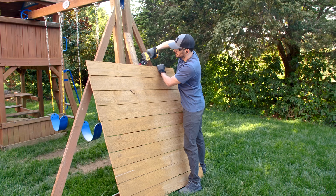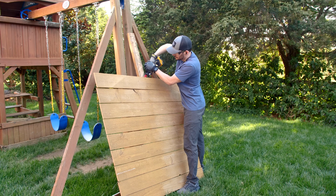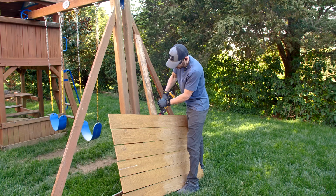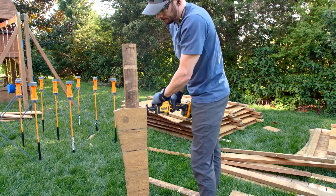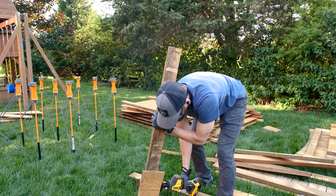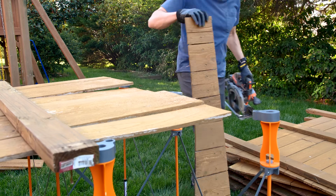Well, a lot faster was an understatement. This metal blade sliced right through the nails, and my one-handed recip saw was perfect for this job. I was mowing through these things with some speed and feeling a lot better about my salvage job at this point. I could also use the same technique on those top and bottom rails to remove the small bits of pickets, and then I would have some usable 2x4s. One down and 11 more to go.